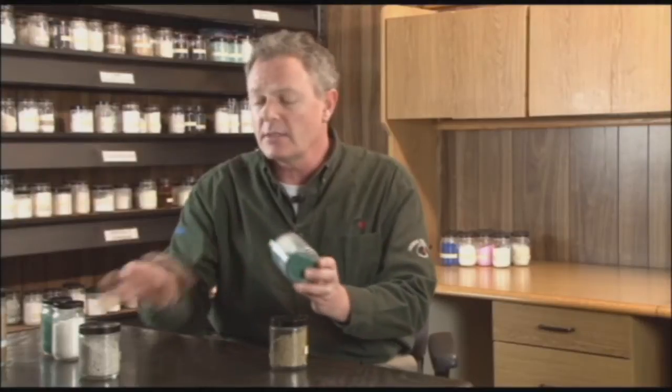The Roller Mixer is very versatile. It can handle fine-cut fertilizer materials as well as coarse grain. Whether you're going to put on a 4% coating or up to a 12 or 16% coating, the Roller Mixer works well because we can apply that polymer material onto all the surface area of the fertilizer, which is critical. You don't want any areas that are not coated uniformly or some areas that have too much — it's really imperative that these fertilizer substrates are coated evenly.